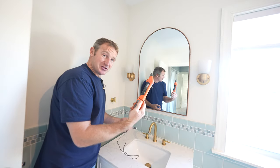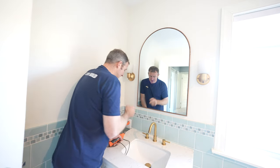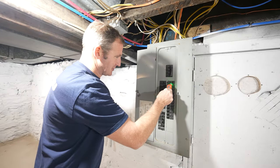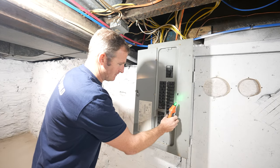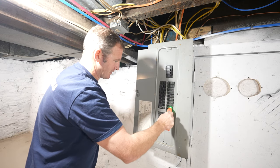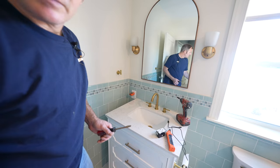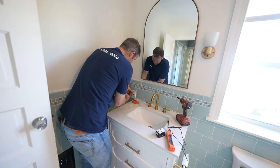First thing I need to do is use my little circuit finder tool here to find out which breaker this is, go downstairs and find the breaker. We'll bring this down here until it turns red. We got that turned off, so we got the power off. Let's go ahead and take our GFI out.